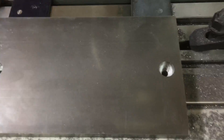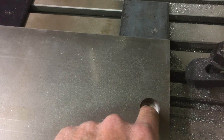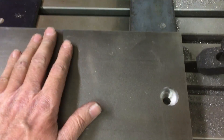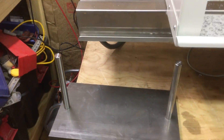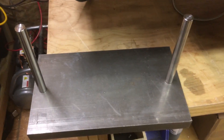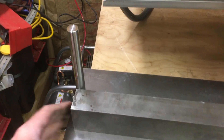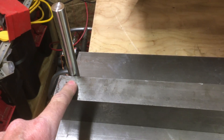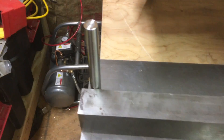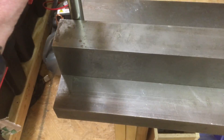It was a little hard to show the machining of those deep holes so far down in there, plus I had a lot of squeaking — I just sped it up so the squeaking was shorter. As you can see, the rods just get inserted like that and I just have to put some nuts on the bottom side. The next part is to do the bottom of the die — this will slide over, I have to make holes in here and do a counter bore for the spring that's going to sit down inside there.